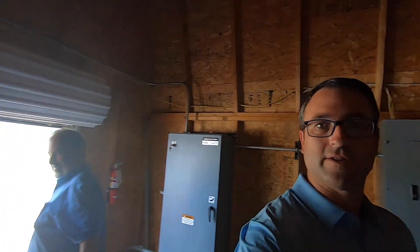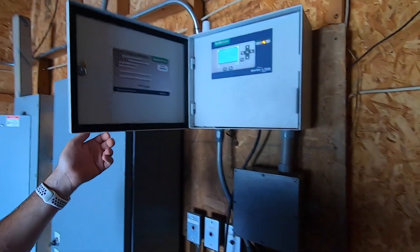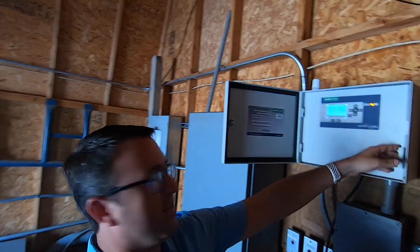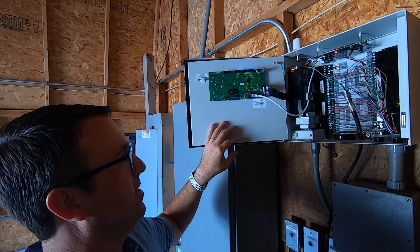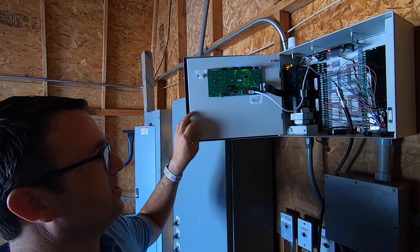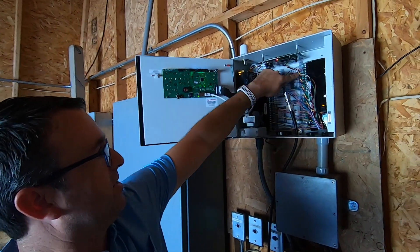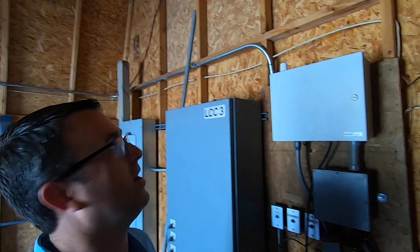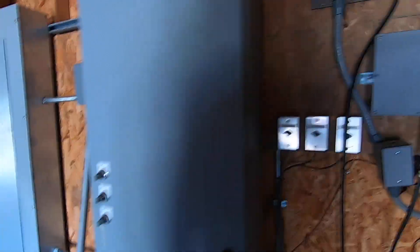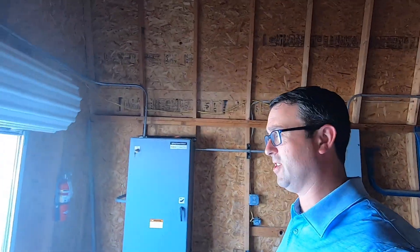All right, we're back here for day two at City of Fishers. We're in one of their storage and utility barns that has the substation where we replaced the two-core equipment. The substation communicates to the 3200 controller via an Ethernet radio. The Ethernet radio is mounted here and it's essentially a junction box of traditional wiring, working directly off the 3200 controller. These became zones of the 3200 controller — zones 29, down here, all the way up through 56 up here — going a couple hundred yards back to the controller. The antenna comes out of the bottom of the controller, loops around, and then goes up to the top with a 6 dB gain omnidirectional antenna.